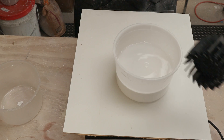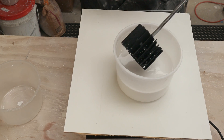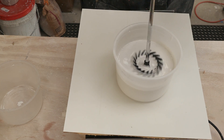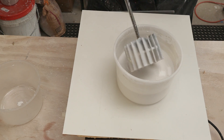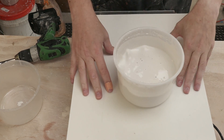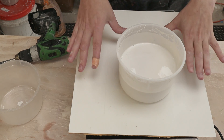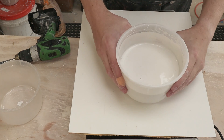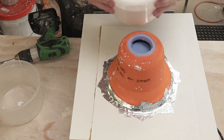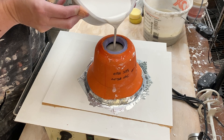All right, that's done slaking. Now I have my paddle attachment — instead of sucking air down it will push the plaster out. At least that's the theory. All right, that's four minutes. I went ahead and bumped up the table setting. Let's let that shake for 30 seconds, which is something I didn't do before. I've got a few bubbles on the surface — hopefully they don't stick around. And here's my mold. Let's go ahead and pour the plaster in, trying to do a thin stream to help pop bubbles along the way.